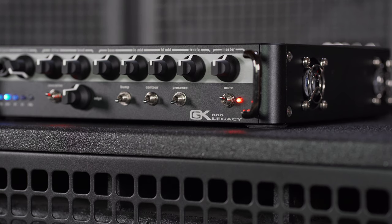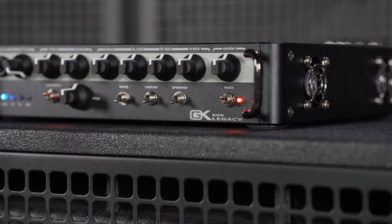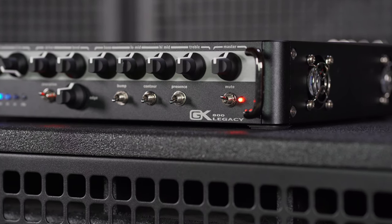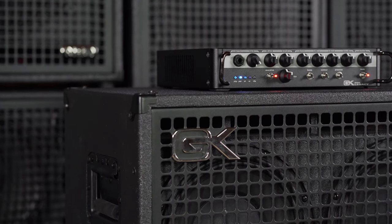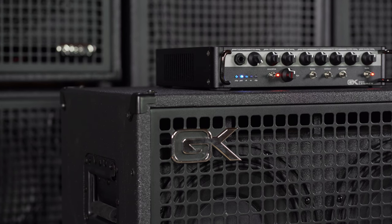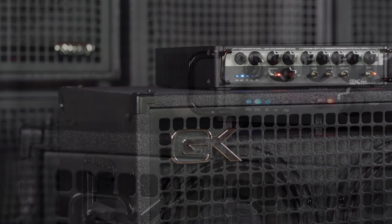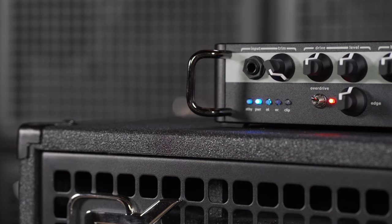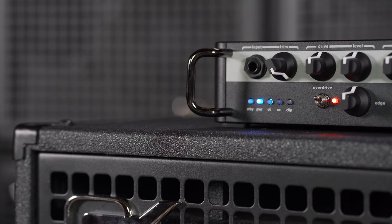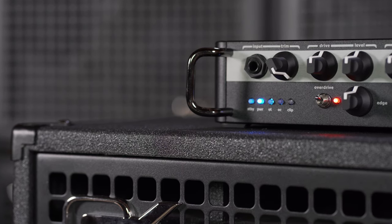Our interconnections, we don't use cables to interconnect our audio signal. It's all done with multi-layer circuit boards and gold-on-gold connectors. So what's the beauty of that? Well, a multi-layer circuit board includes its own shielding for all the wires, so you don't get any extraneous noise, and they always behave the same. The boards are bolted in place, and there's never a problem with a cable getting misplaced inside the amplifier and creating problems. And then the connectors are all gold. So they connect gold to gold. And the beauty of that is they never corrode and they never give you a connection problem years down the line.